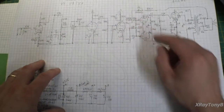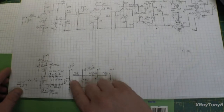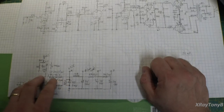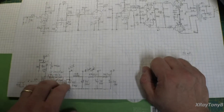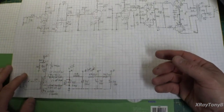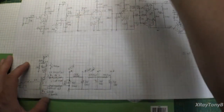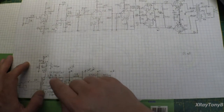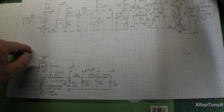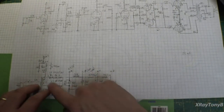Down here on the power supply, it's pretty basic — the same power supply Fender uses on all of their solid-state rectified designs. You could also put a vacuum tube in here, but tubes have a voltage drop of 15 to 20 volts, and I need all the voltage I can get with this transformer. Also, solid states don't have as much sag under heavy load, and since this is a bass amp, the bass notes are going to draw a lot more current. So for that reason, I went with solid state.